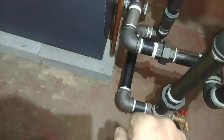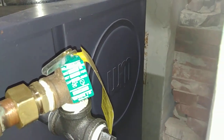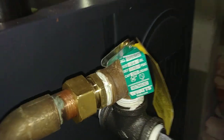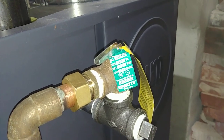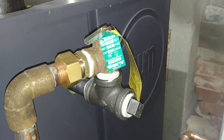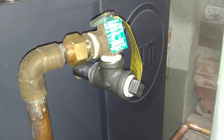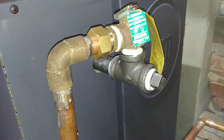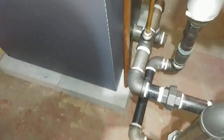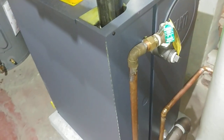There's the drain for the drips — the wet return. There is the relief valve as usual, 15 pound. This is the relief that comes with the boiler. We install it with a T which is plugged so that it can be inspected and cleaned as it fills with dirt every once in a while. And we repurpose the drip so that the discharge is safely directed should it happen to open.